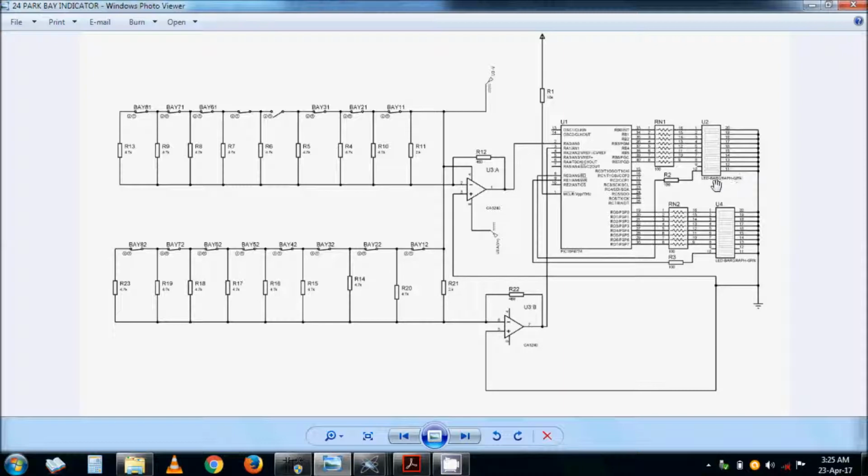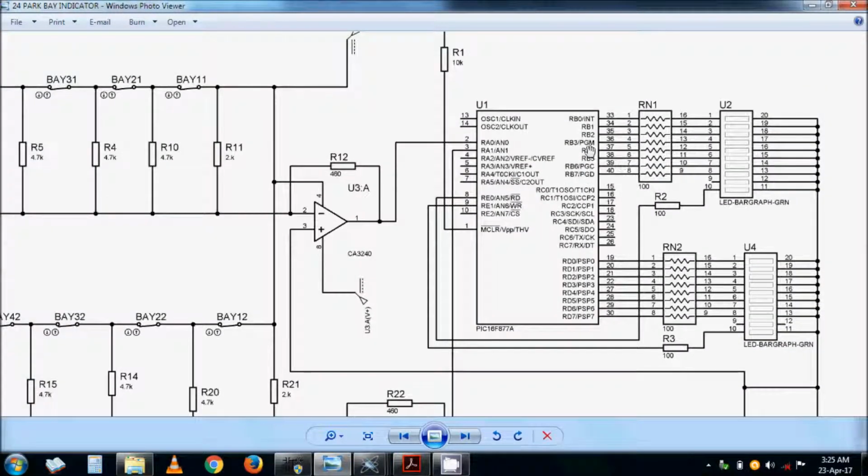So how it indicates, please remember, in practical circuits the microcontroller does not drive straight to the display like that. You would have to have interface circuits here, like the relay drivers. You drive the lighting using relays. A ULN2803 IC is a good relay driver. For prototyping and small indication, of course you can do it this way, but this is mostly for explanation only.